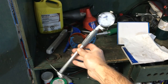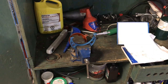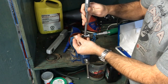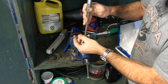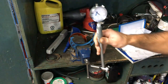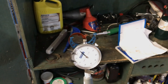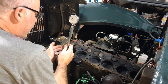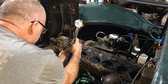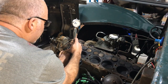What I've got here is my bore dial gauge. I've set my micrometer to exactly 3.375 bore. Next I have to zero that gauge at that bore — we know we're stock bore on this car. I basically got to set it so that the lowest number I read on here is zero, by rocking it back and forth. So when I rock this gauge and it gets to zero, it's going to be exactly 3.375 inches. That's my zero. When I go inside that little lip at the top of the ridge of the cylinder, the lowest number I get is zero — that's 3 and 3/8, the stock original bore.